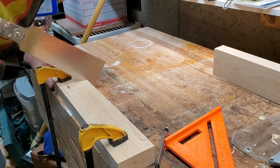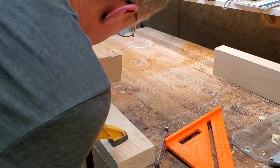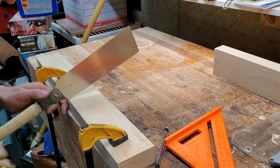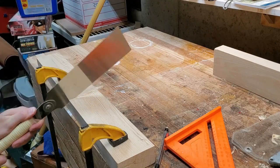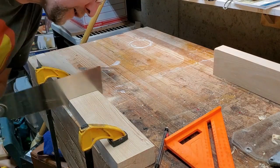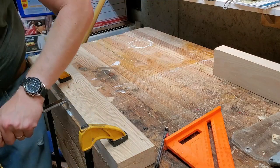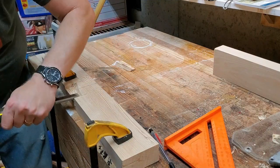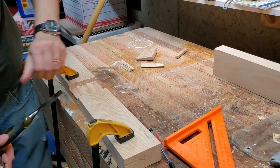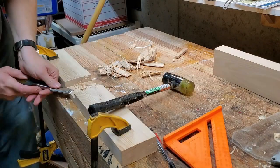What I've got to do here is cut down just to the half-thickness mark I made on each side of the lap joint. I'm trying to get it as even as possible. These Japanese saws are really nice for this kind of work. I know traditional western joinery would use a different kind of saw, but this Japanese saw works great. I'm going to combine Japanese and western tools here — using my chisel to cut out most of the waste wood in the middle of the lap joint, working up from the marking line so I don't cut too deep.